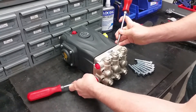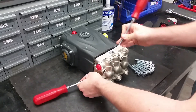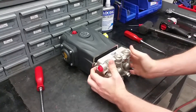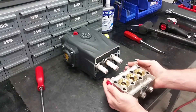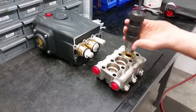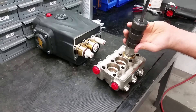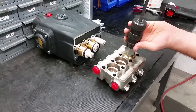Be careful not to apply too much pressure on one side of the pump, because this can crack one of the ceramic pistons. Once the manifold is off, there will be parts either on the pistons or still in the head of the machine. To take out parts still in the head, you can use a rear piston guide extractor, which we sell on our website.